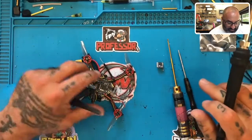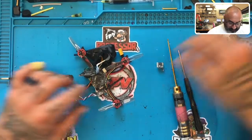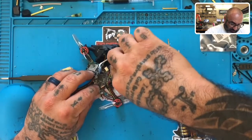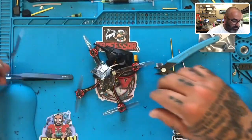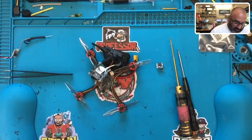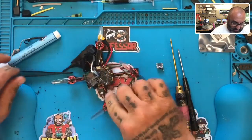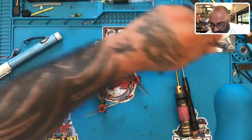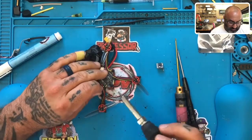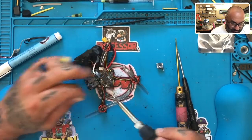So this is the JTMCU ELRS. This is the SP245. This comes with — we'll take that off and take the antenna as well. Now it's time to get the ELRS set up. We're going to have to get the TX pad right here set up, so I'm going to go ahead and tin that. The TX, the RX, the ground and the 5-volt there.